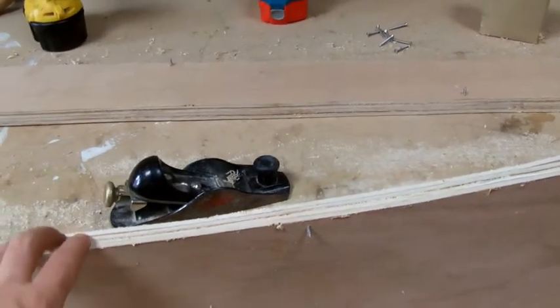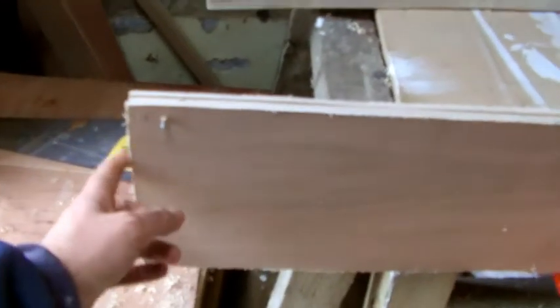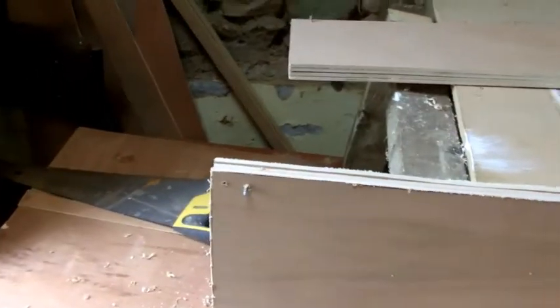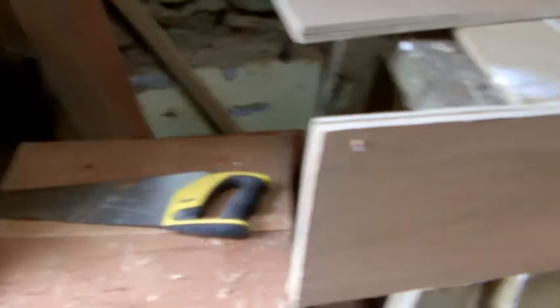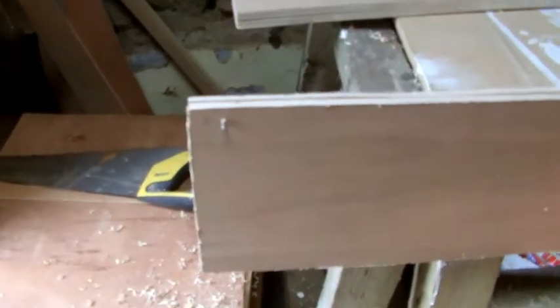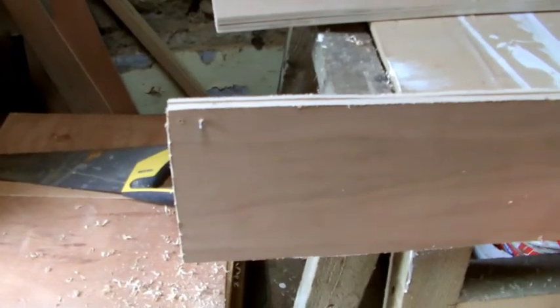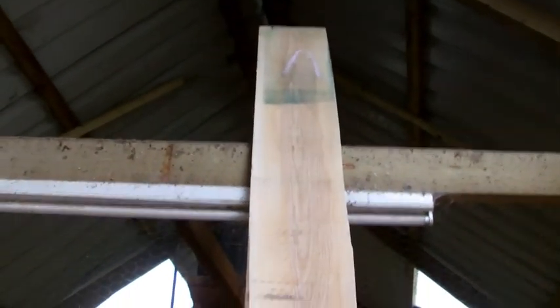There are four panels here - this is bow and stern, half of the canoe. These will be joined here as a butt joint to make the full eight foot length, and then the other section - the duplicate - will come out from this side and be butt strapped in the middle, clamped with two pieces of wire and then a small piece of fibreglass tape either side. That will be left to cure, and whilst that's curing I shall be preparing this piece of ash and making it into the gunwales and the thwarts and so on. Okay, brilliant.